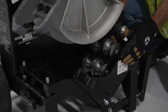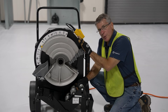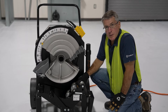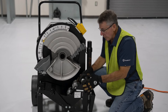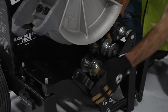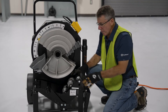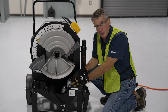The rollers are stiff and strong and built to tight tolerances. And just like straight track shoe mounting, rigid rollers align perfectly with the grooves in the shoe, so they contribute to less conduit scarring and smoother bends. The other benefit of strong, stiff rollers that track accurately with the grooves in the shoe is that the engagement of the pressure roller system is much easier. So the whole process is made much smoother and easier because of a rigid, stiff roller system that tracks accurately with the grooves in the shoe.